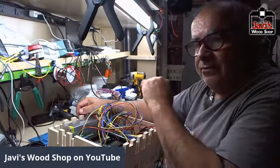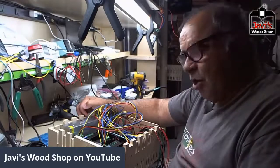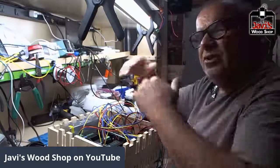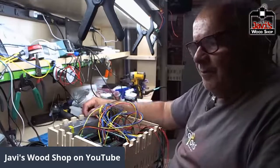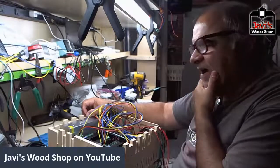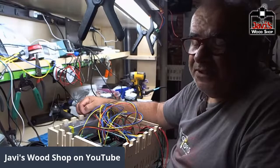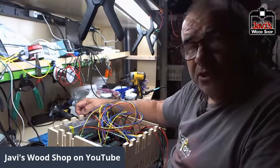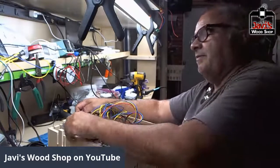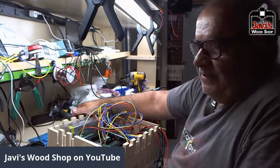And what they're doing is they sent it right away to the truss department, because that takes about 3 weeks to do all the truss plans. They called me 3 or 4 days ago. They had an issue with multi-level. I was going to have the living room be high up, like 9'4", and then the rest of the house 8 foot. But they said it's either one or the other, because of the design of the house, it won't work with the trusses. I said, okay, fine, let's make it all 8 foot. I'll save a hell of a lot of money. I kind of wanted the 9 foot, but I'm not the one cleaning the house, so the boss said she'd prefer it smaller, and hey, I have a happy marriage for a reason.